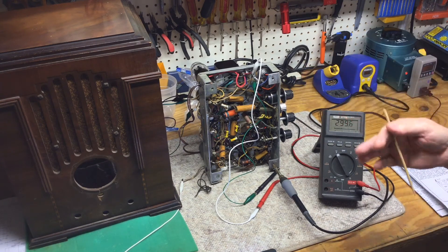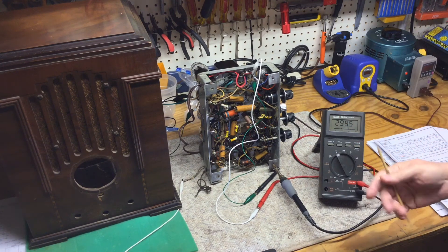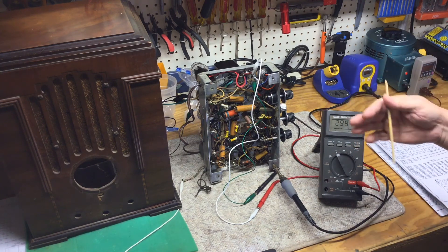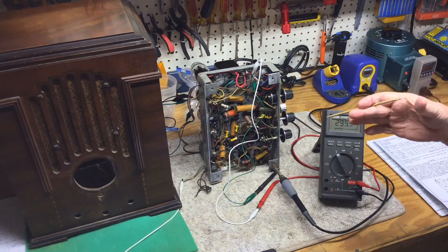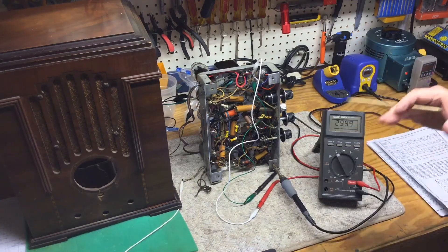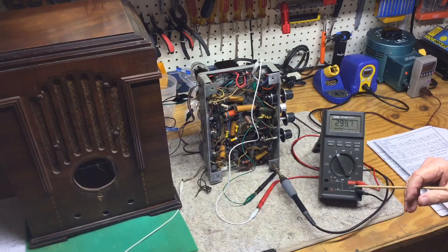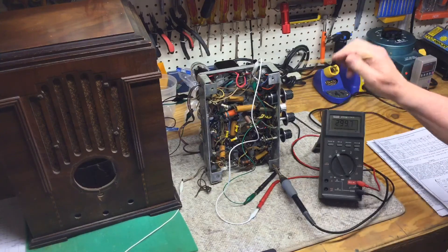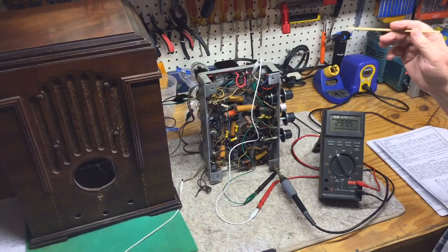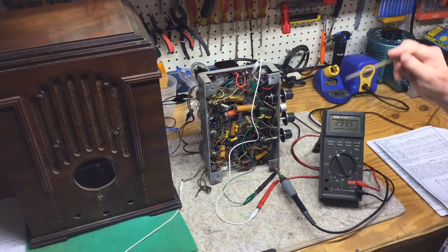The radio's playing better than I expected — I actually didn't have any expectation of whether it would work or not. It's great to know all the innards are in good shape. I had already checked the DC resistance of the oscillator coil, antenna coil, and the IF, but it's nice to see everything come together and know that at least those parts and pieces are in great shape. I think the restoration itself will be pretty straightforward — just getting all these paper caps out and replacing all the resistors that are out of tolerance.